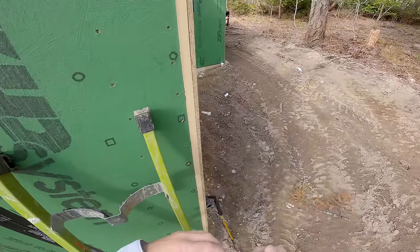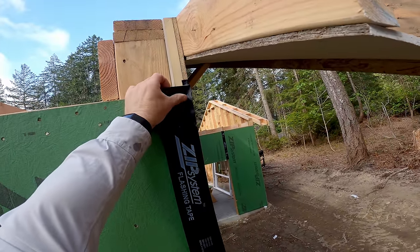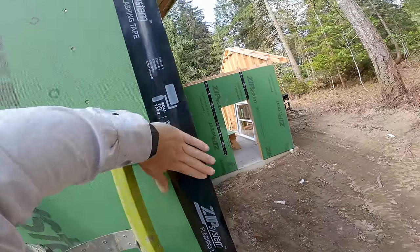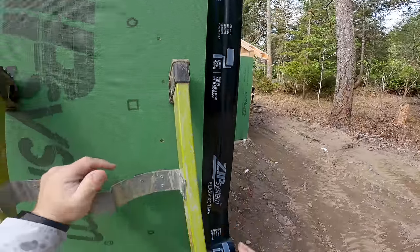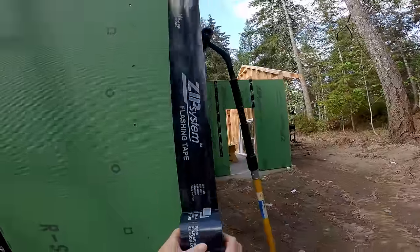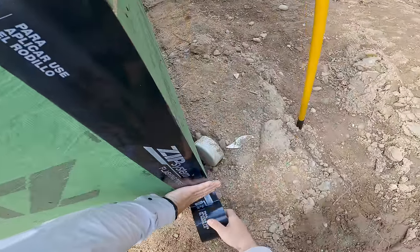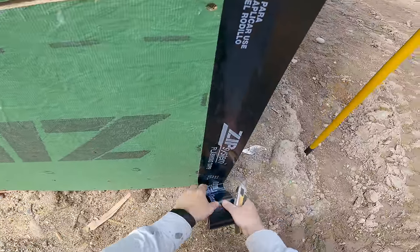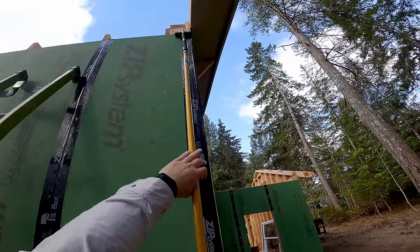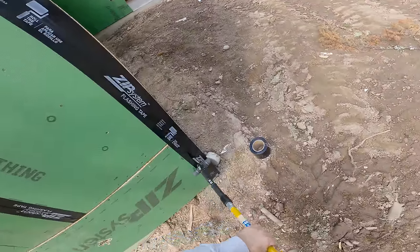Here on the opposite end of the house, I have a wall that's abutting my rake wall. You can see that the end panel on the rake wall has the exposed poly ISO. The first layer of tape goes from the right-hand side — the outside zip panel — fully covers the poly ISO, and tapes the adjoining panel. I work my way down, smoothing it as I go with my hand. I like to roll the tape as I go. Always, always roll the tape. As I smoothed it with my hand working my way down, I made sure there were no wrinkles, and by pressing it in with the roller I know I've got good adhesion.